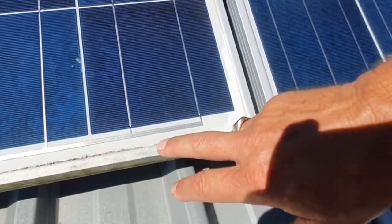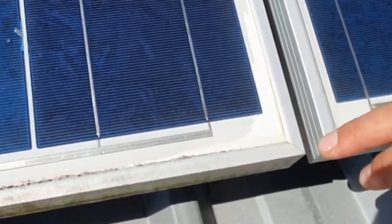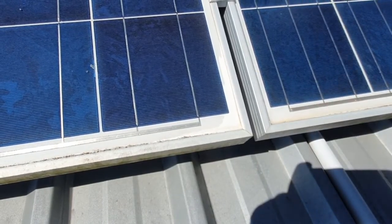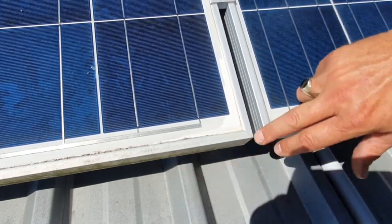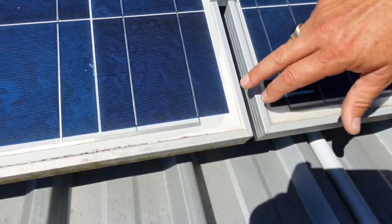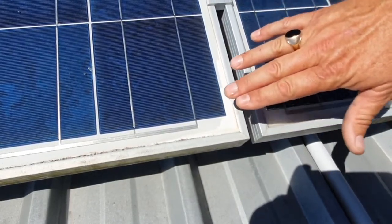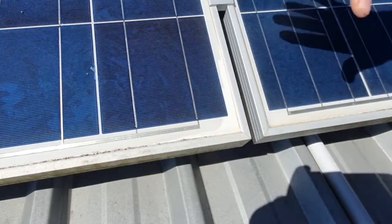You can see that moisture has got into the exposed glass edge. What we recommend to prevent this is the Glastgen product we talked about earlier, which would seal that exposed edge and prevent moisture going in — because as that spreads, you'll see the EVA interlayer bubble and then you'll lose efficiency in the panel.